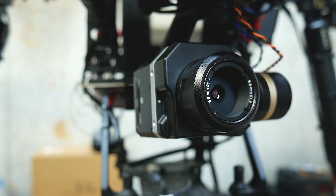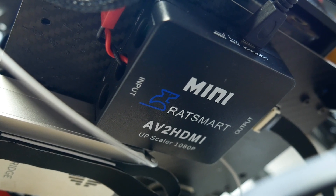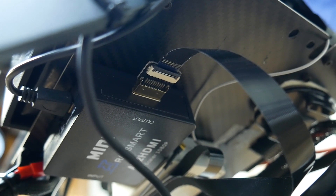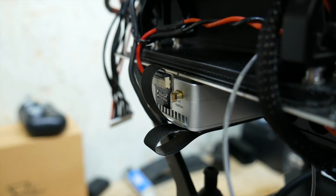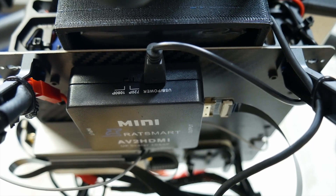As an extra bonus on this FLIR View Pro camera — everybody that has this camera knows it only has an AV out signal. So I'm going to show you what I've done to convert that to an HDMI signal. This is an AV to HDMI converter — it takes the AV signal in and you get an HDMI signal out. You'll need to purchase an HDMI flat ribbon cable: full-size HDMI on one side, and micro HDMI on the other side that plugs into the Light Bridge air unit. You can get this cable off eBay. You also need to power it with a 5-volt source.